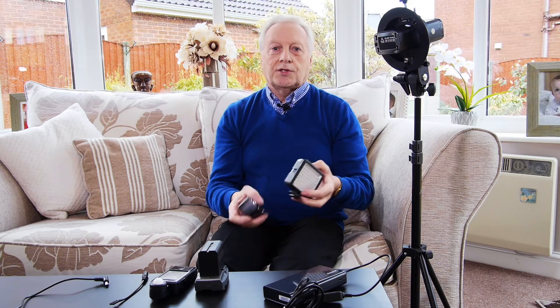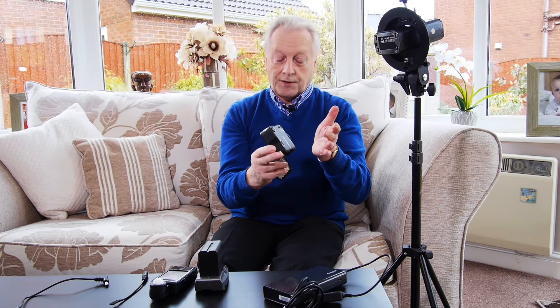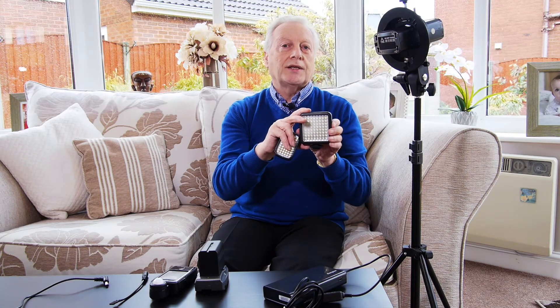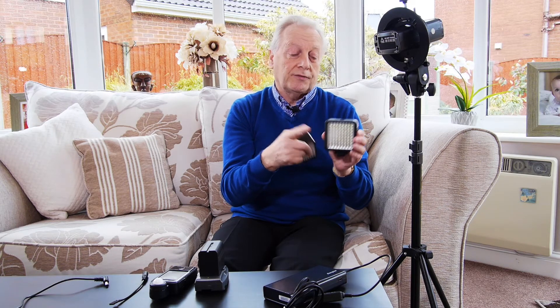You might ask why modify the ADL when Godox make a 64 LED matrix that's self-contained with the necessary mount for going on a tripod or a hot shoe. It has an adjustable power supply so you can vary the intensity, running from 5 volts or four nickel-metal hydride cells. It's fantastic, but it's slightly green and not quite as powerful as the ADL 60-matrix LED. There's about 250 lux difference between the two units — that's about two-tenths of a stop in terms of exposure. Not very much, but I prefer the colour from the ADL. The Godox unit tends to be slightly green, and while you could gel it to correct that, you'd lose light output by applying gels.